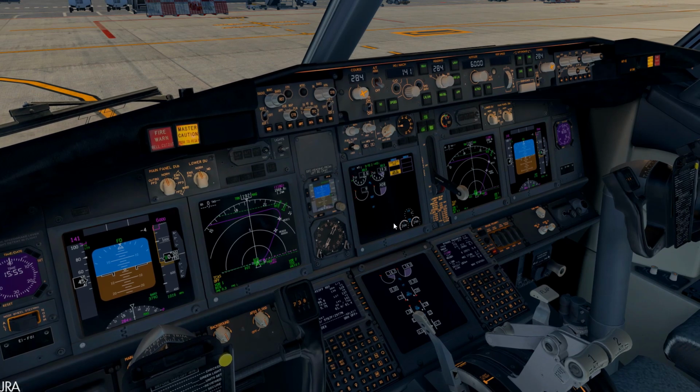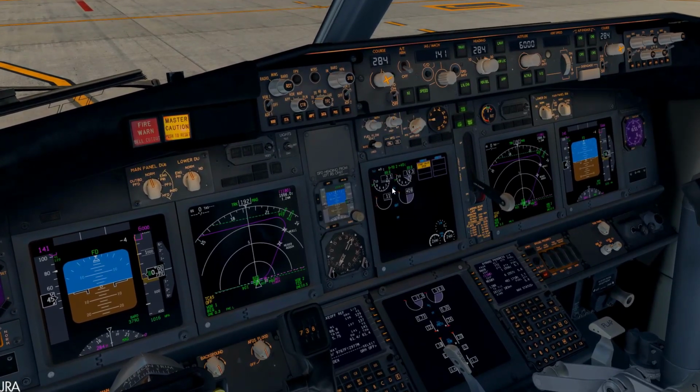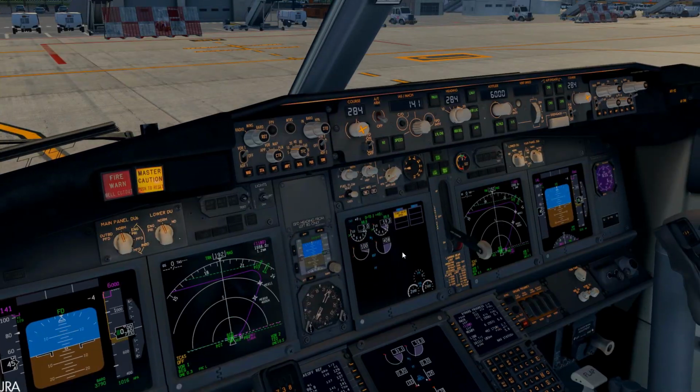Oil pressure rising. Low oil pressure extinguished. 25 fuel in. Fuel flow. EGT, fuel's ignited. And that's peaked off again at 479, well within limits again. And that's decreasing. Start's cut out. Start valve shut. And through 424, that's stabilised.